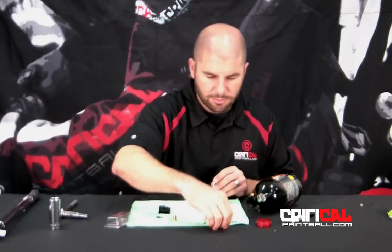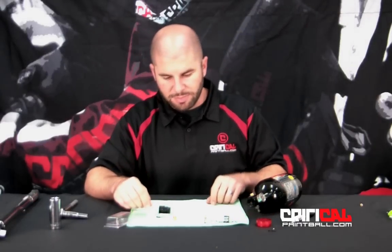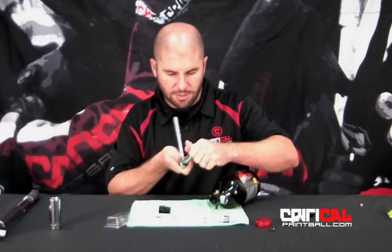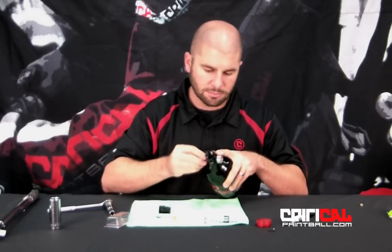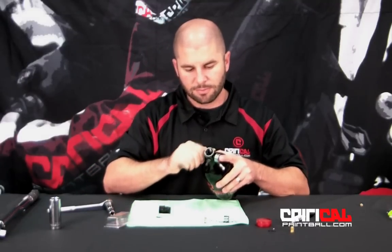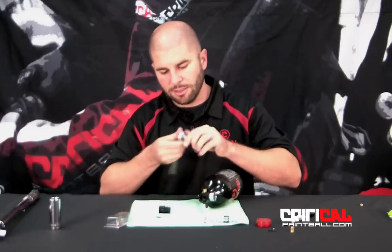So we'll go ahead and replace it for this — I just wanted to show you that as a way to kind of get yourself out of a jam. We'll put the O-rings aside. Now we have a fresh piston, and let's assume that this 1800 burst disc blew. Go ahead and take that off using our 3/8 inch wrench. So we're completely rebuilding this here. Go ahead and put a new 1800 burst disc on there and tighten it on.